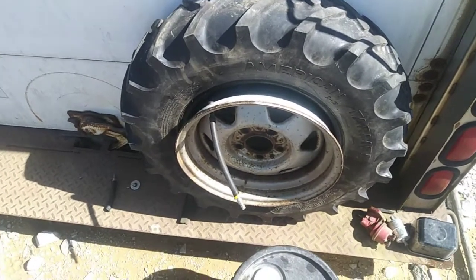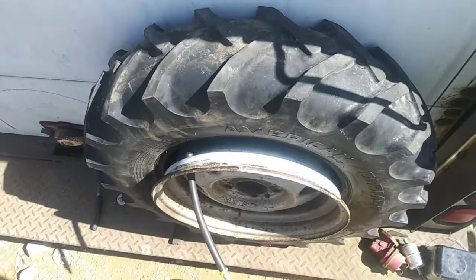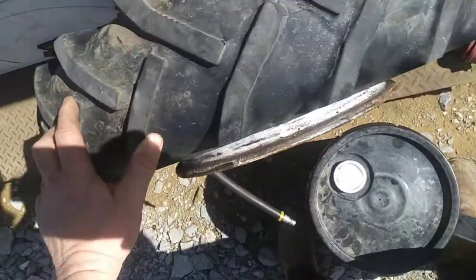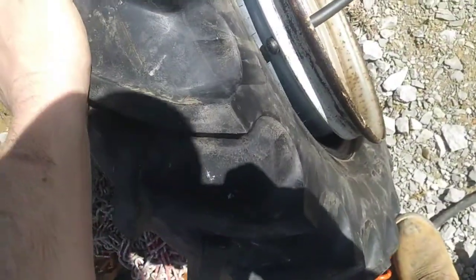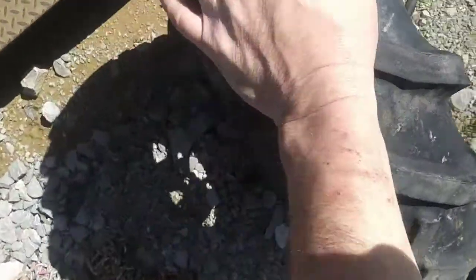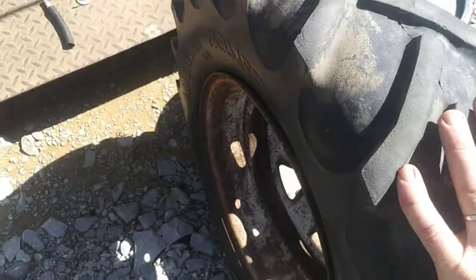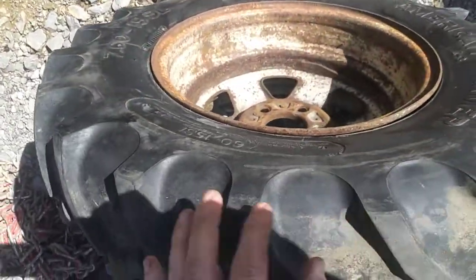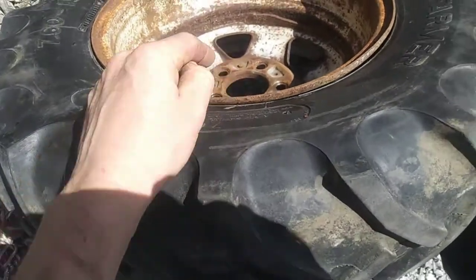Making a real quick video on how to not use ether on a really bad tire offset. It's a front tire from a four-wheel drive tractor — probably meant for a four-inch rim — and I'm putting it on a seven-inch rim. Ether works better than just about anything, but it's dangerous. Step one: get one bead on.